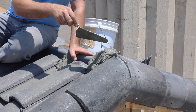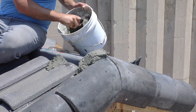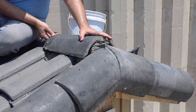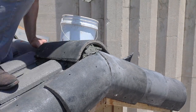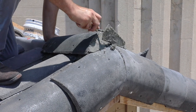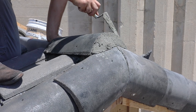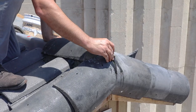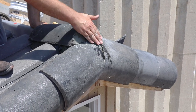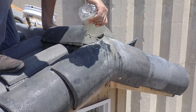Generally when working in this area, I prefer to put a little bit of extra mortar and then press it down with the ridge itself. This is just as much aesthetics as it is waterproofing, if not more. So you can pick the color of mortar and how far you want it sticking out, if at all. This gap here you can fill with mortar, but I'd generally like to fill it with caulking to give it a little more flexibility and adhesion. And of course we'll give it a final wash.